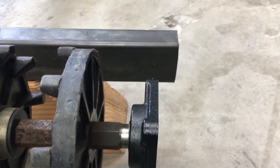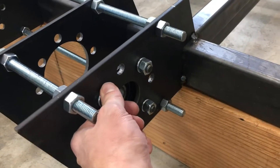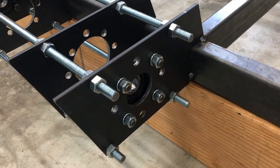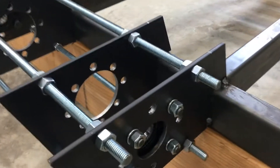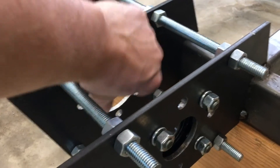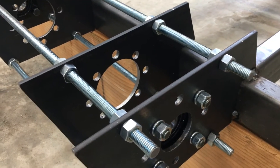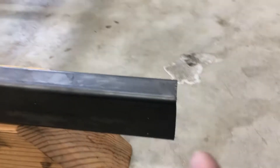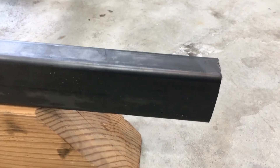Everything is working out great — all the bolt holes lined up perfectly for the bearings. I ordered six bearings but I only need four. Part of the plan is to bolt on another bearing in here and use a piece of one inch cold rolled shaft, so between the two bearings at this end I should be able to have everything aligned perfectly out to the far side. That'll help me get the bearing mount set up exactly where it needs to be without having to monkey around too much. Let's get started.